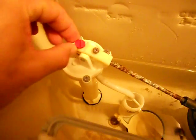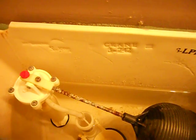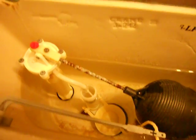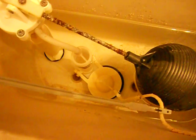This little red screw here can be turned by hand if you can get a good enough grip on it, because there are little notches on the side, or as you can see, with a standard straight screwdriver. Every time you make a small adjustment, only turn it about a half turn per try, then go flush the toilet and see where the water stops. Now, if your water level is already in the proper place but your toilet still flushes itself, the next most common culprit is going to be the flapper itself.